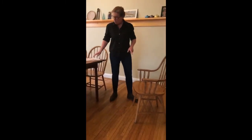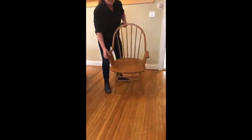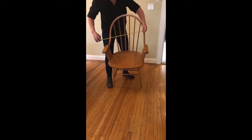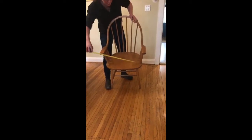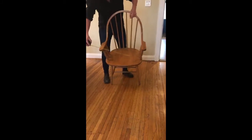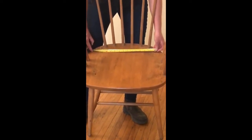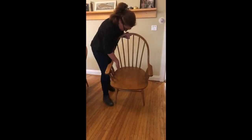I've written in width at the front and width at the back — for your chair those two dimensions might be the same or they might be different. With this chair it's a little bit difficult to measure very precisely, but that's okay, we're just going to get as close as we can. We're always thinking about functional measurements, so the width is 19.5 inches overall, but I have to fit in between these two spindles. What's really critical is the width between those two spindles, which looks like about 16.5 at the front and pretty close to the same — maybe a little bit narrower — at the back.